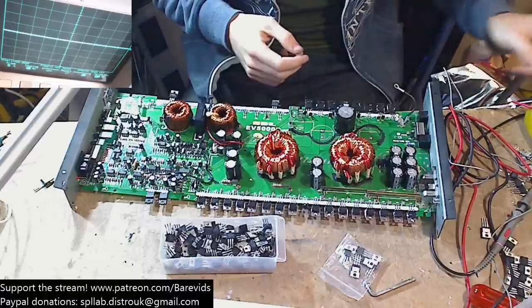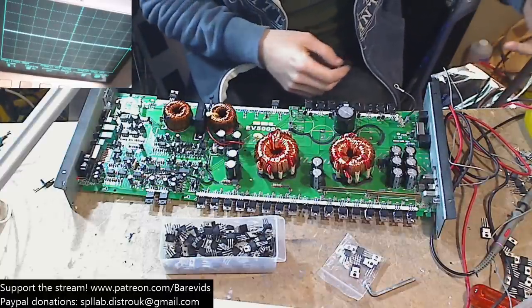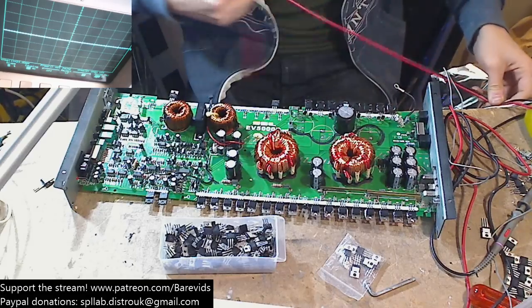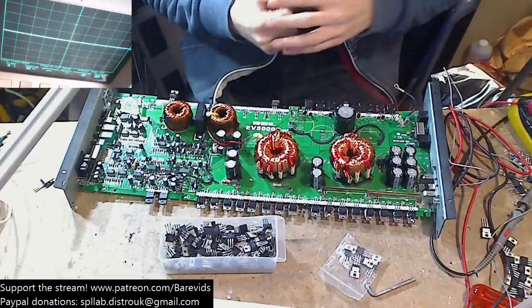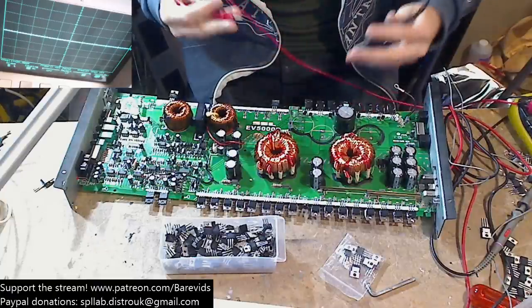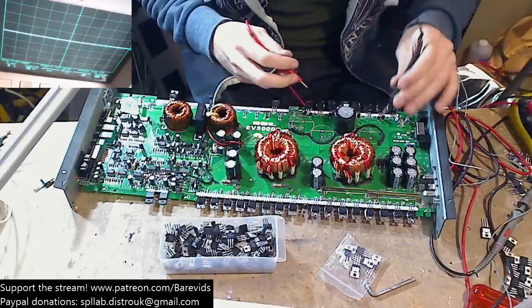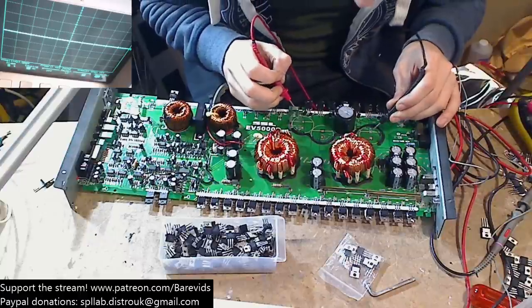Okay, let's fit one of the second rail caps. Problem is, the only reason I wasn't fitting the rail caps just now is because from other amplifiers, it makes things a lot safer. If there's an issue with the output section, if the FETs blow, then it doesn't dump all the rail cap storage through the blown component and backwards to the drive circuit. Which is not what I want to do, so let's just see. I've got one there, I just want to make sure to see what...